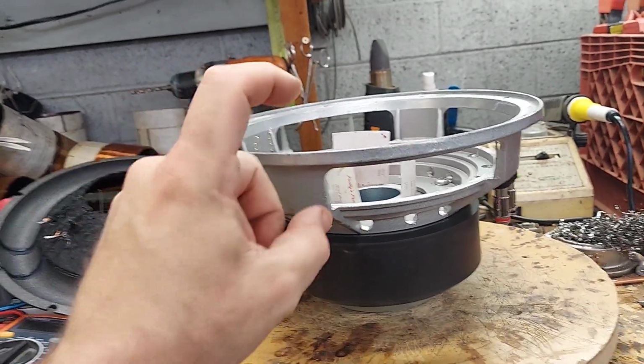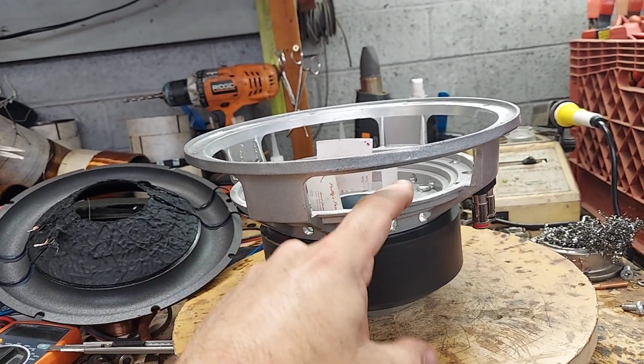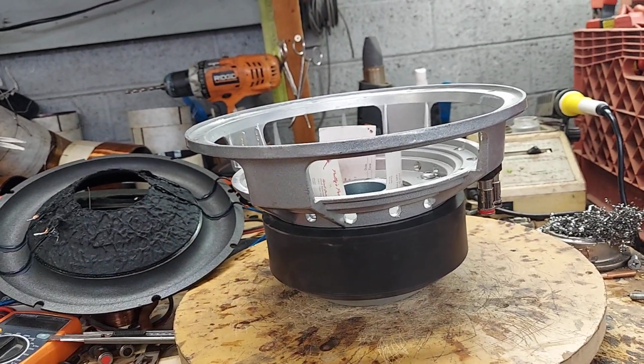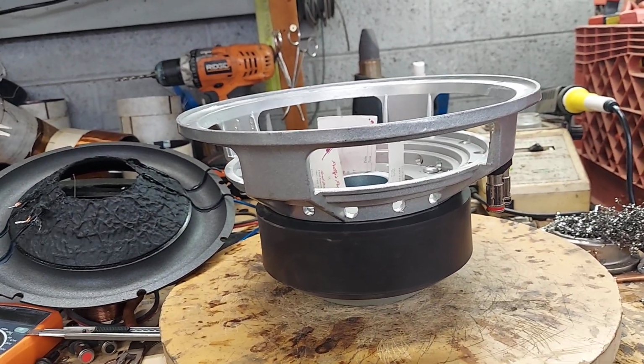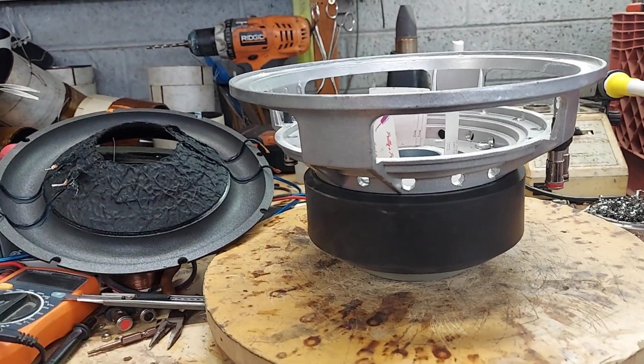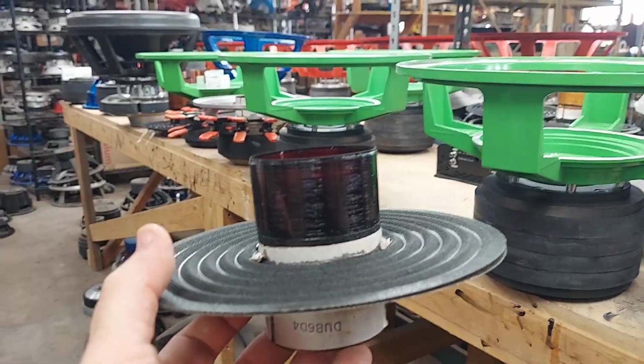In this case, this is more appropriate. This is basically a 2.5-inch coil, 2 3/4, and we're using an 8-inch spider, which is plenty. We'll get full excursion, which will be about 2-inch peak-to-peak linear, and that's a mechanical number, not like X-Max. Let me see if I can show you the coil. That looks like about 50 millimeters, so 2 inches.